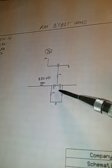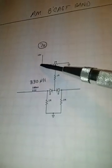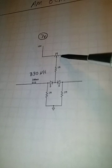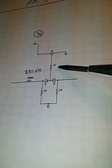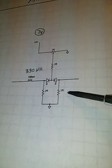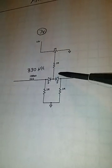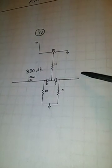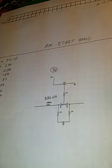I'm putting them in back-to-back, cathode to cathode. We started out with 12 volts, which is about as far as you want to go with them, and a little divider network — 1 meg or 100k — and then isolating them from the 50-ohm input and 50-ohm output with a 1-meg resistor down to the anodes. To complete the circuit, the same thing on each anode, so the cathode feeds and the anode feeds are balanced, bringing this to the center of VCC.